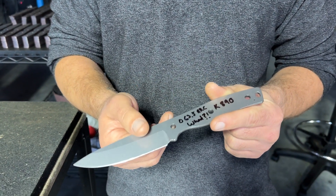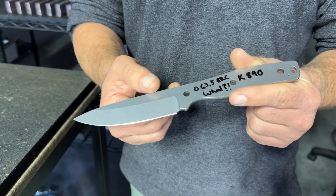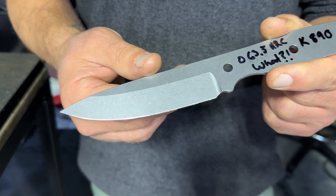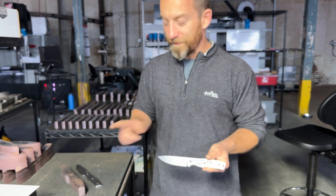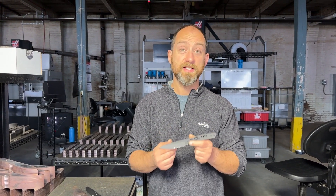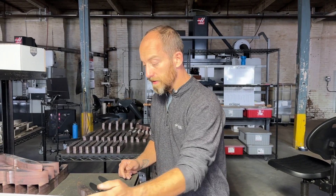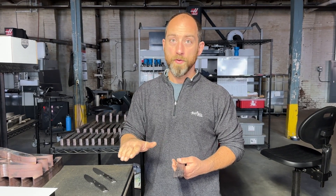We had a mix-up — we had a few samples of a higher hardness and a few samples of a lower hardness, and I had done initial destruction testing with unfinished blanks so I knew which was which. But I worked some through samples after I figured out that the lower temperature was slightly more durable, so we ran with that for our first production batch. Then I got these samples mixed up, but I went over and Rockwell tested it this morning across the street just to confirm. Our first batch is all done to the lower value at 61 to 62, which is even a little tougher — I couldn't notice any difference in edge holding — so we just went with what had the slightly higher damage threshold.